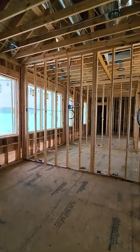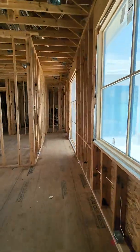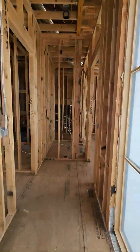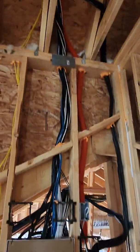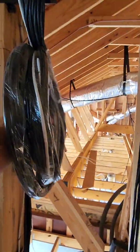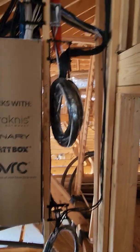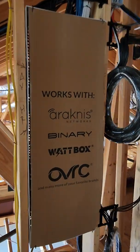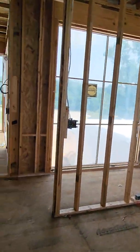Okay coming upstairs, we've got just basic TVs in every room, nothing special up here. Coming over here we have all of our AV cable coming in running down — this is our home run, everything is completely wire-combed, coming into the box, Saran wrapped, labeled, ready to go. We also have our shade wires down below so we'll be able to mount our shade drivers and LED drivers on this wall. Right over here we'll put our network switches, and the two-gang boxes up above are where our speaker wires will feed back through.